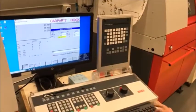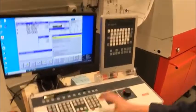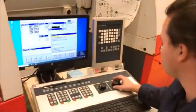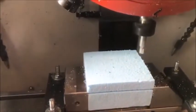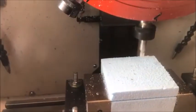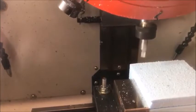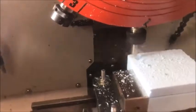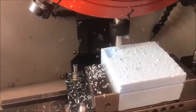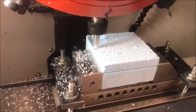I change my offset back to the height of the part, go to the top of my code, make sure dry run is turned off — because if we don't run the motors we really need to make sure they run. I turn my speed really down and hit go. The machine turns on and isn't moving because I'm at one percent speed; I then speed it up, it goes to its first location at Z35, goes into the part, and starts cutting. I'll pause the recording and resume at the end of the operation.